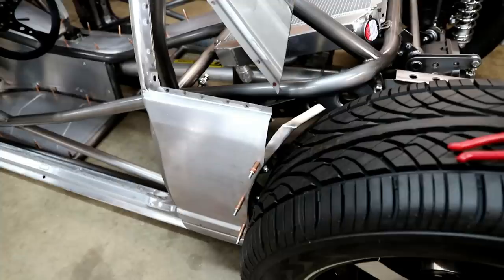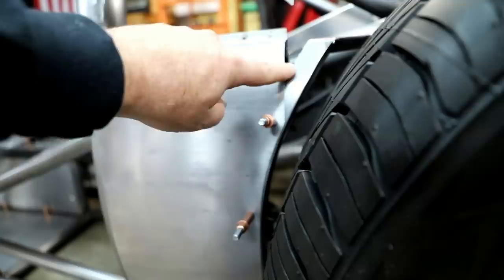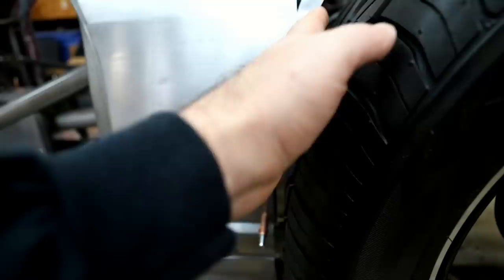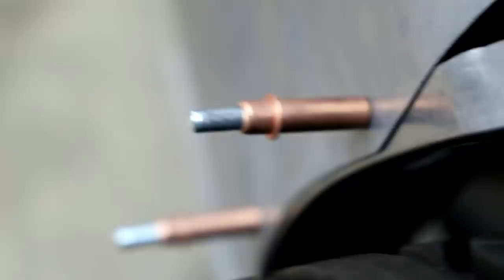Before I get started, let me show you why you would want to stretch or shrink metal. I'm working on the bibster and I want to make some inner fenders. I take these three-quarter by three-quarter strips and you want to make them match the tire. You want to stretch it so it curves like this, but also because the actual body itself comes in, you have to shrink the inside of it to get it to mold or fit the shape of the body line.